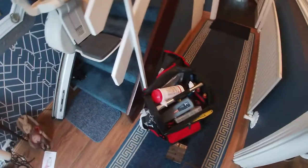Can I borrow you for one sec? I just want to show you something. Did the company put this in? Right. You see this here? That's a 240 volt line. If that gets on the rail, someone's getting fried. So they should tack that in. The funny thing is you could do everything else wrong, but that's the thing that'll kill someone, especially as it's near the track. So I'm going to tack that if you're okay with that.